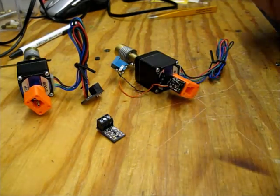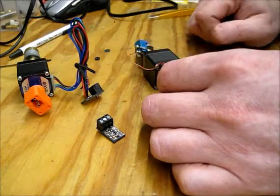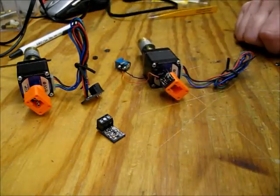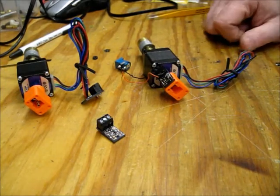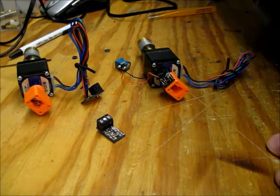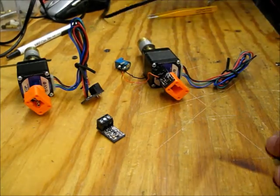A good question beyond your mind is, how long do you need to hold it there? That's based on room temperature, part temperature, solder composition, flux type, everything. The short answer is the longer the better. Usually about 30-40 seconds seems to do it.